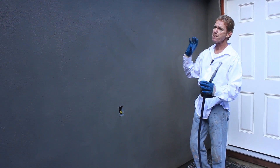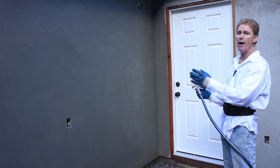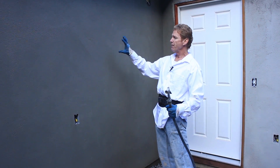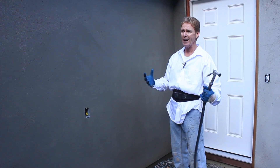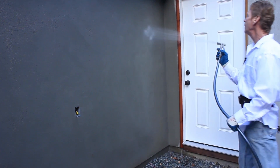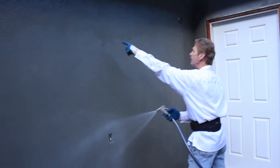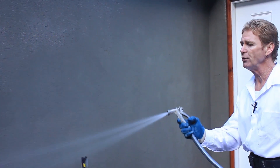What I want to do is give it about 10 to 15 minutes. I already know this is going to start drying out. I want the scratch coat and the brown coat to be moist, and I want it where, when we apply the color, that inch-thick base takes about eight hours to fully dry out. If I apply a color coat right now, it'll dry out in about an hour because only the top is wet. You see how it's starting to seep down here — that means the water is being sucked in. It's one of the most important things you can do when doing a color coat.